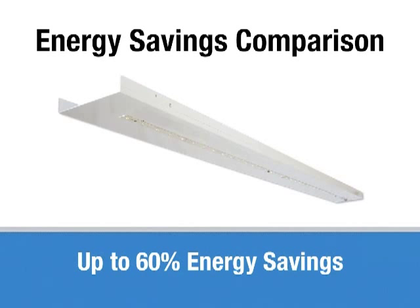This is a long-life product manufactured in the United States. 5,000 Kelvin color temperature is our standard. It has an L70 estimated life over 70,000 hours and produces 85 lumens per watt. This provides a nice energy retrofit for strip configurations where you have a 4-foot or 8-foot channel that you wish to convert to a more energy-efficient and long-lasting technology.